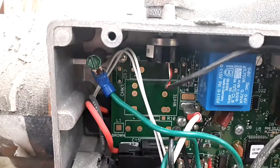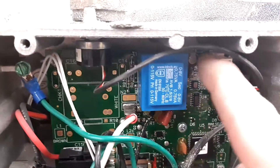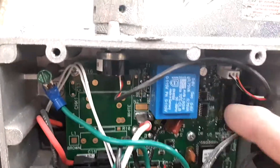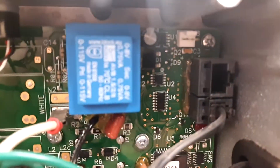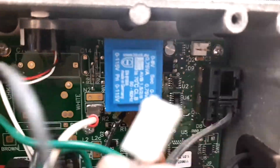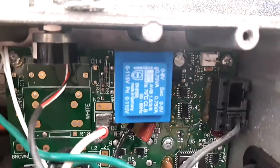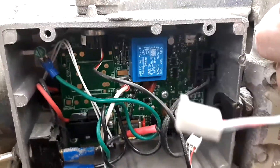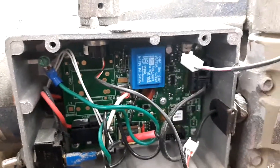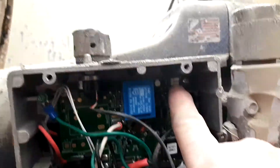You're going to remove the top nut, and once you do that this potentiometer will just drop right down into the control box. Reach over to the wire — if you just pull the wire it'll pull right off. You can see it's a white connector, and this is a white connection here as well, so there's no wrong wire, no wrong place to plug it in. On the connection there's a lip at the top — that lip goes up to grab onto the clip.